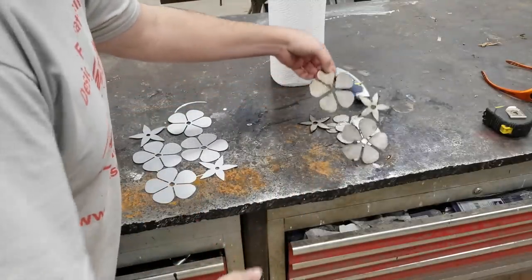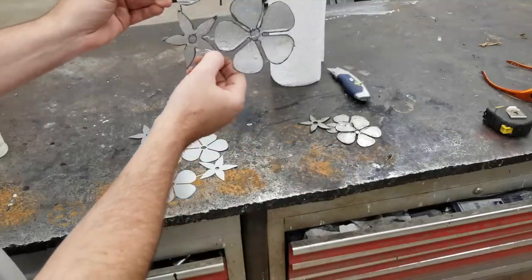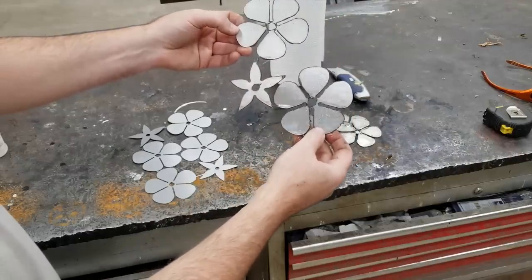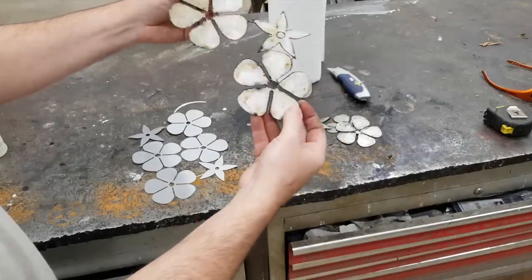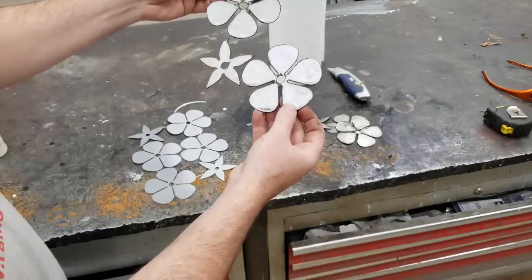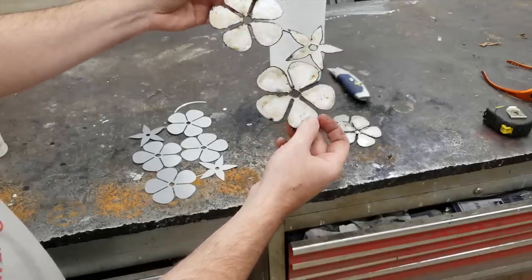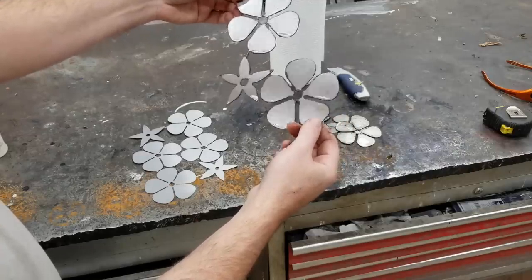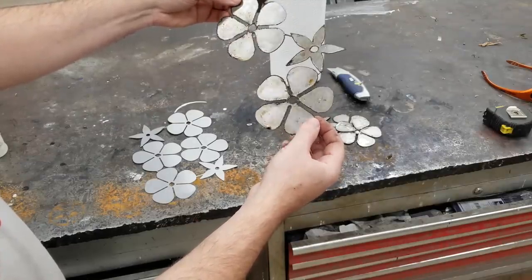This is the plasma side. You can see in a few areas it almost nipped the bridge away, and in other areas it completely blew it away. I can't remember exactly what the bridge size was on it, but that's the back of it, and it really doesn't make any sense to pre-grain your cold rolled or anything before plasma because you have a lot of cleanup work to do getting it cleaned up. And on the back there's lots of dross.